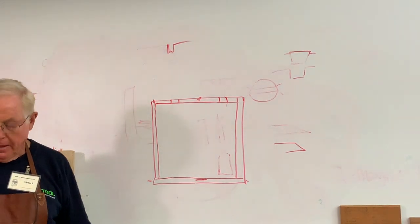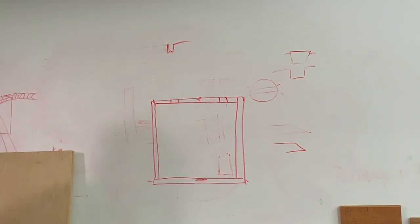The other thing you look for is on the feet, the bottoms of them. The feet on sugar chests and jelly cupboards and all that sort of stuff should be discolored. They should look different. They should look dark. And the reason is, if you were living back in those times and you had sugar or cakes or something perishable stored in one of those compartments, what are you going to do about bugs? You don't have any Raid to put on. What are you going to do? Well, what they did was take a fruit jar lid, fill it with kerosene or coal oil, as it would have been called, and set the feet in a fruit jar lid filled with coal oil. Ants couldn't cross it. It soaks up in the feet and stains the feet. They're all that way. Originals are all that way.